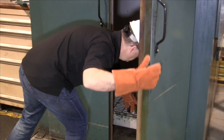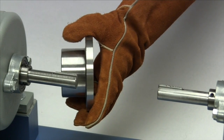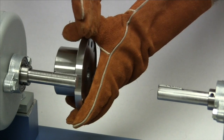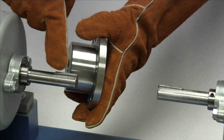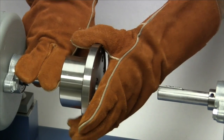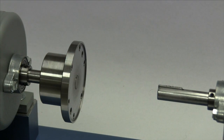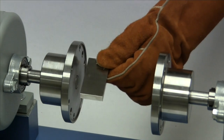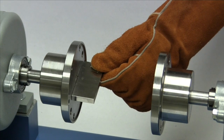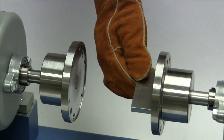When the hubs reach the recommended temperature, the bores will be expanded enough to provide a few thousandths of clearance when sliding the hubs onto the shafts. Make sure each hub is oriented with the flanged end facing the end of the shafts. The keys should already be in place in the keyways, and the hubs should slide onto the shaft with little or no difficulty. Each hub will start cooling down right away and you will need to work quickly and accurately to position the hubs on the shafts, as once the hubs cool down, they could be quite difficult to reposition. When the hubs are in position, the flanged end of the hub should be in line with the end of the shaft and the end of the key. Let the hubs cool to ambient or room temperature before continuing.